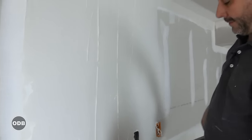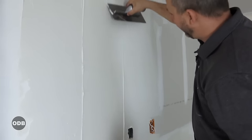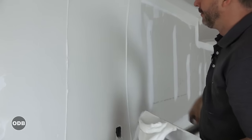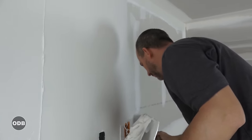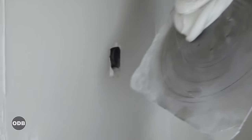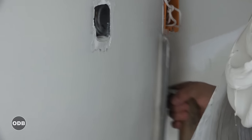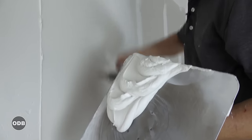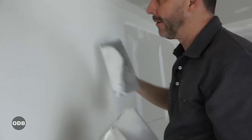This is one of the benefits of using the hawk — now I clean the metal, put in that pressure just a little bit towards the outside. The goal here is to make it nice and smooth. Now I've got some more mud, and now that I've taken it off I can stretch this joint out a little bit.